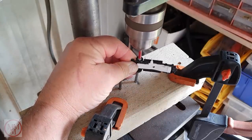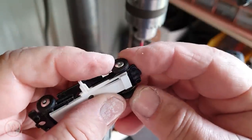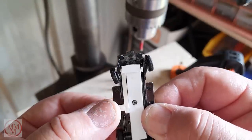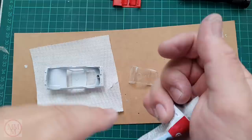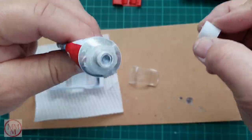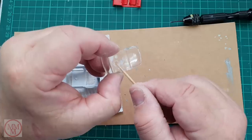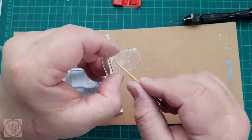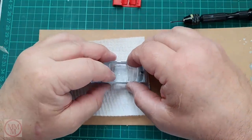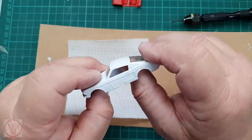Using that hollowed out nail - one in the top and one in the bottom - and just grinding that end, turning it into a mushroomed end. And look at this - that looks better than new. I've just got to glue this cleaned windscreen back in now using a tiny little blob of clear silicone. I used to use Araldite, and then somebody pointed out that if I used silicone in the future I could just remove the windscreen if necessary to clean it again, and it wouldn't get broken trying to force it out as it would if you glued it in with epoxy resin.